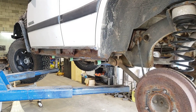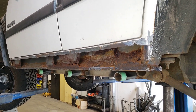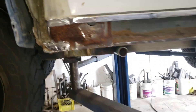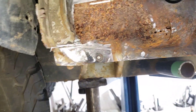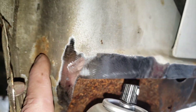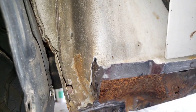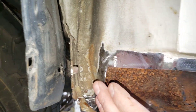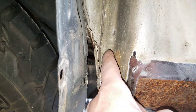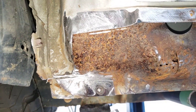I have cut out as much of the rust as is going to be cut out. The customer removed virtually all of it — I just cut the little bit that was underneath the fender. Now we've got reasonably clean metal to work with all the way around. It's really thin up in here and there's some rust bubbling I'll grind down. When I go to patch this, I'll wrap a patch right up into here and overlap all that material, welding up and around it so it's doubled up in strength, rather than trying to weld to lacy old rusty metal.